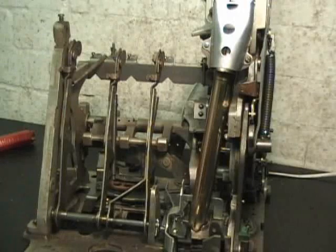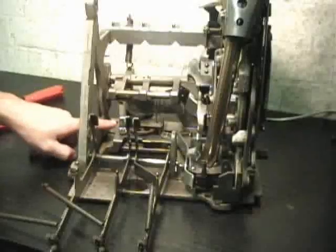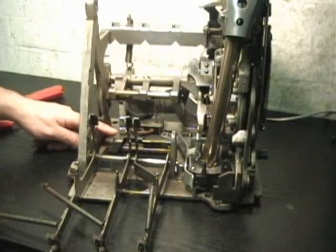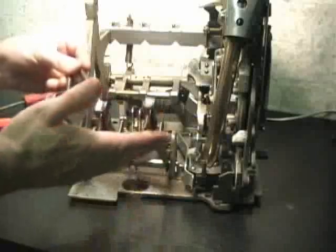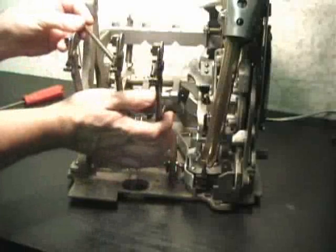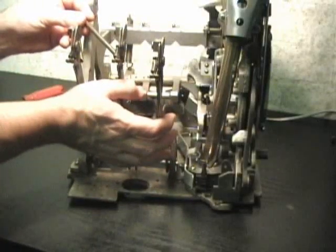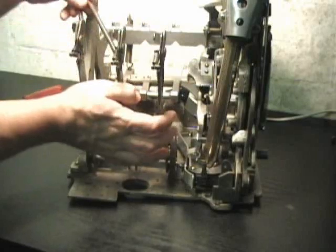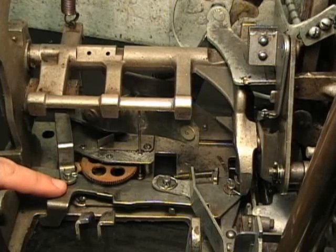The other thing that happens are these three brakes. As the cam moves forward it moves these brakes out of the way — remember these three brakes are the ones that hold the reels static. So as the clock winds up it pushes that timer bar just here, and this pushes the brakes away from the reels.